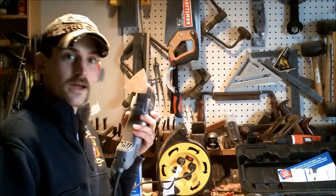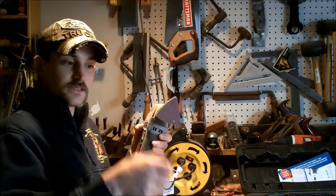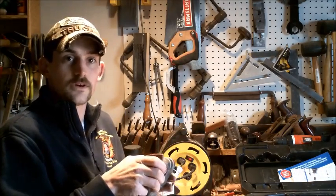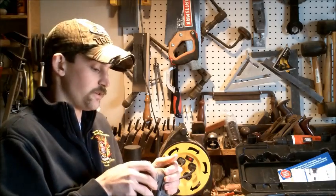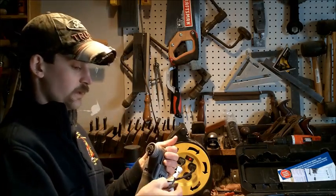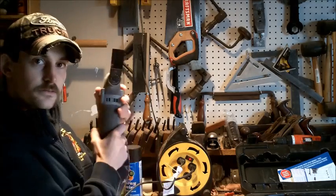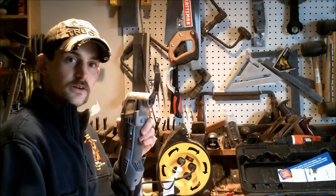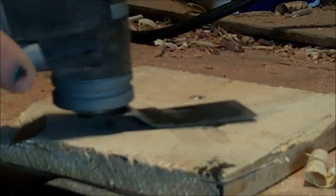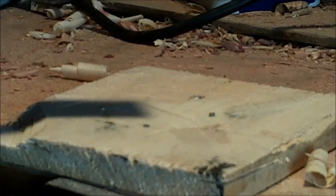Well, with the Dremel Multimax MM40, you've got a metal cutter that sits flush, so you can cut that nail off right where the wood is, and then you don't have to worry about it. And it can be part of the design feature of the pallet. All you gotta do is release your quick lock, take your wood cutter or your metal cutter, put it on there, snap it back together, and you're ready to go. It cuts it just like going through butter.